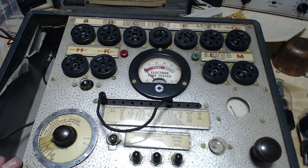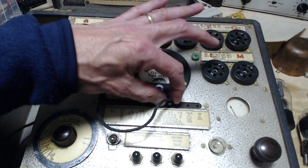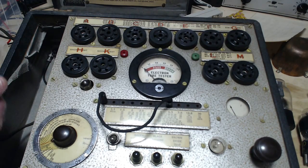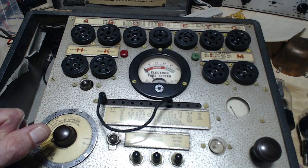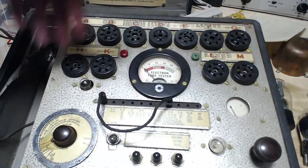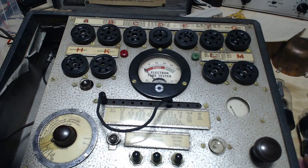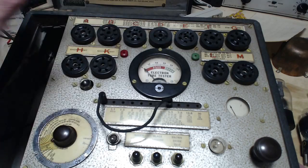I did get out the voltmeter. I wanted to check the filament voltage before I plugged the tube in — the filament voltage was dead on based on the position of this dial. That's pretty impressive. Then I looked at what we were putting on the plate of the tube, and it looks like 35 volts AC. I didn't read any DC. It could be that there's no tube inside here, no rectification taking place — it is actually putting an AC voltage onto the plate, and somehow making this appear on the meter.